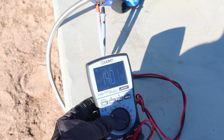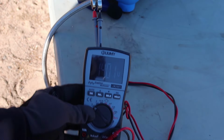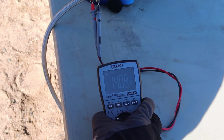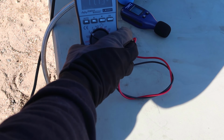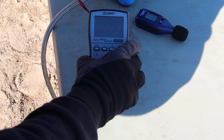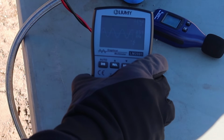Now I know if I don't do it, I'm going to get asked. I'm plugging in the battery clamps to the 12 volt output on the generator. Let's see what kind of voltage we're getting and what kind of sine wave we get. All right, as you can see, at low idle in eco mode, we're getting 14 volts. Let's put it on regular mode. Doesn't seem to make any difference. Add a load, again, barely any difference. Just a little bit increase in voltage, not much. Hopefully you can see that. The sine wave is perfect, 124 volts at 59 hertz. So we're right on the money.